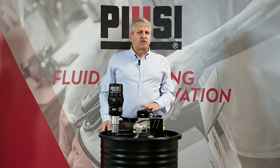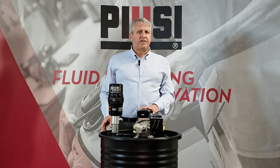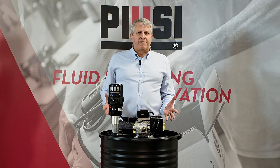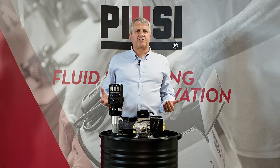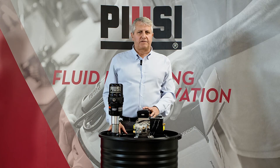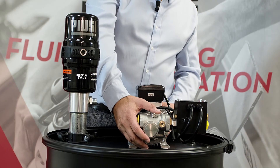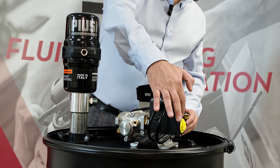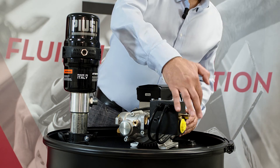The pressure switch is also provided with a safety valve which limits the maximum system pressure to 10 bar. Both pumps are suitable for the application and can be used for fitting single delivery points, also with a reel on a fixed distribution system. In addition, the Viscoflowmat combines the typical characteristics of a gear pump with the simplicity and convenience of being able to activate the pump without worrying about switching the motor on and off manually.